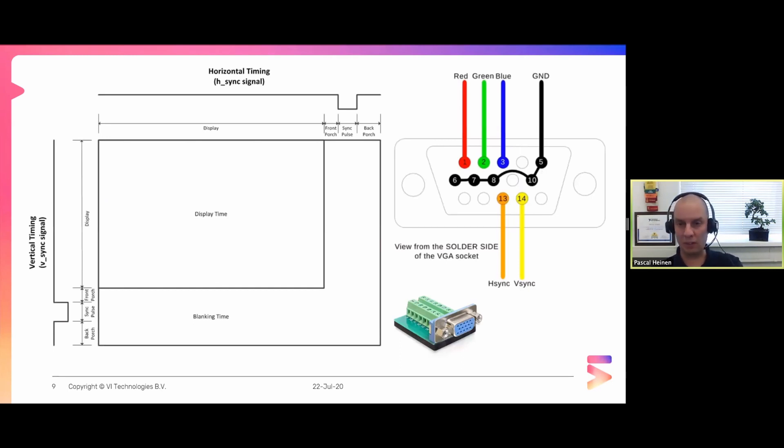This presentation is about Tetris, but first more theory about generating a VGA signal - it's actually relatively easy. On the VGA connector you have five wires directly connected to five digital outputs of your choice, and you need to connect a few pins to ground. Then you have the horizontal sync and vertical sync lines. With all CRT TVs and monitors you have a raster scan line - you're drawing line by line from left to right.